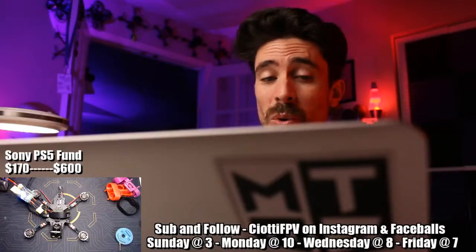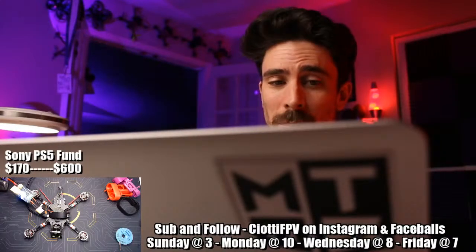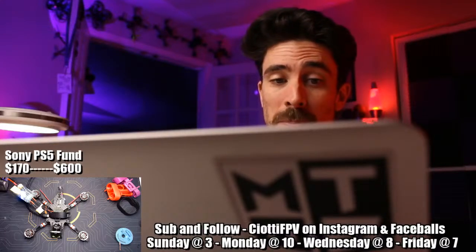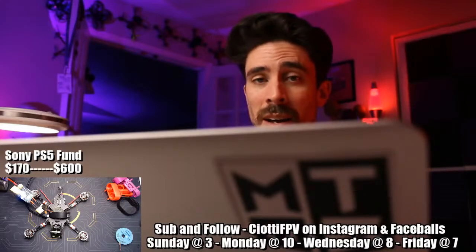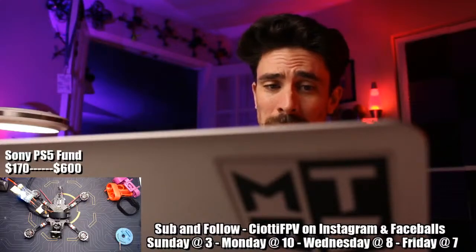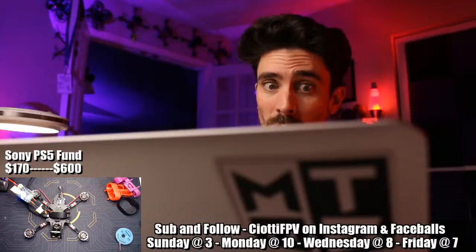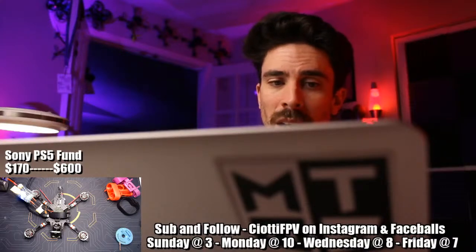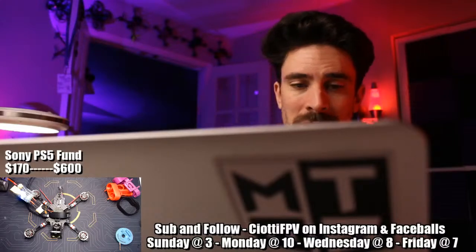Some of the other things that I do in here, I take the beep strength and I turn that down a little bit. The beep strength is the volume of the startup beeps, and I don't want them to be loud. If I'm plugging a quad in the middle of the night, I don't want it to wake up the whole house. So I turn that way down, actually. On 5-inch rigs, I turn it down to like 4 or 3 or 2. On these 3-inch micro-ish rigs, I turn it down to about 10.